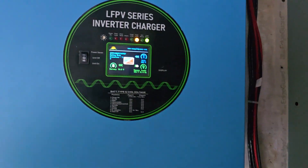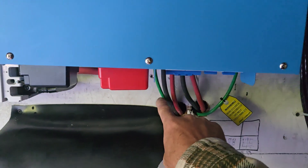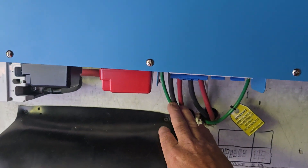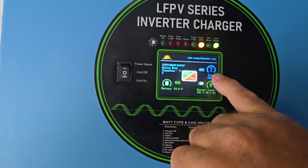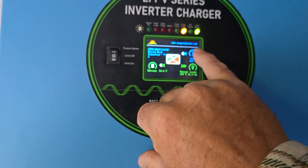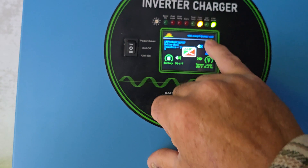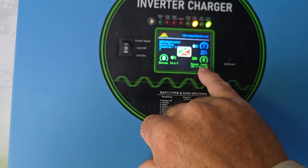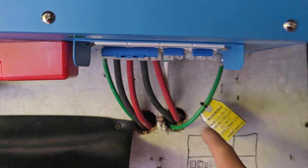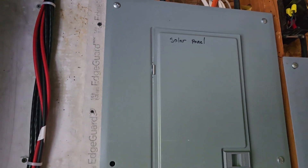What the bypass mode is — you can see right here it says grid power, 240 volts. It's taking power out of our commercial panel; there's a line that goes down in the wall and comes out right here. That's my input power. So it's taking that power and it's bypassing the system, pushing DC power out to the batteries to charge them, and putting 240 volts AC through these lines out to the sub-panel box, which is all the solar circuits.